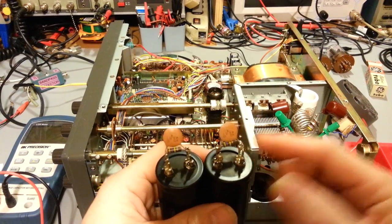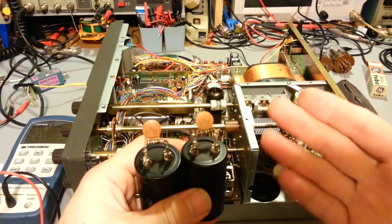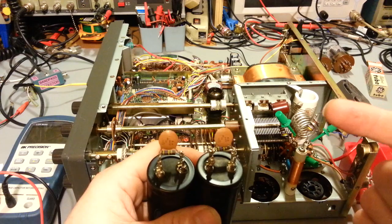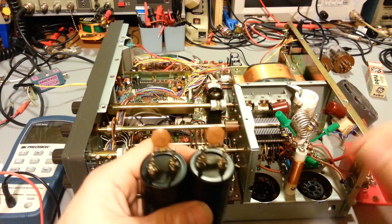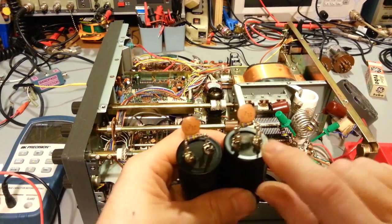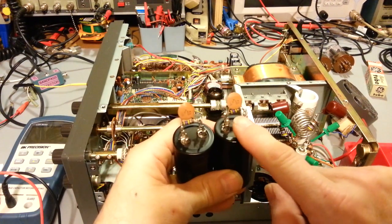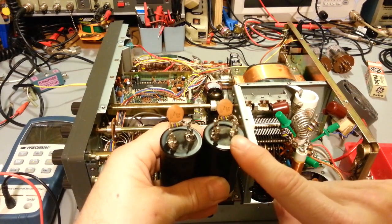When I change these, instead of trying to get these ceramic caps off and these bleeder resistors off, I just leave them on and install new ones. It's those two little parts. It's going to cost more in labor for me to try and get them off, get the leads straightened out, and get them attached to the new ones, than it is just to grab brand new ones and stick them on. So that's what I did. Kind of convenient, I can show you. They do have resistors there, 470K resistors in parallel across the caps.